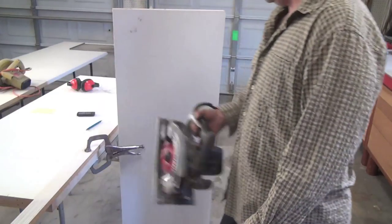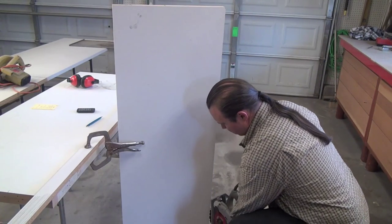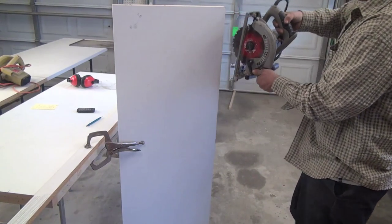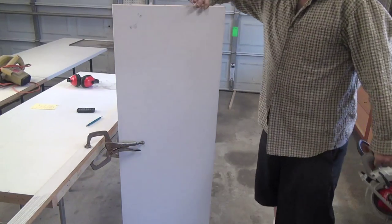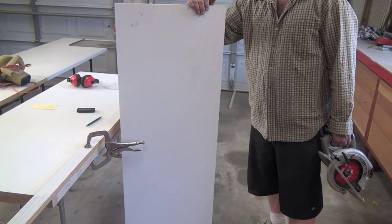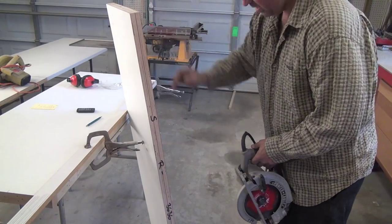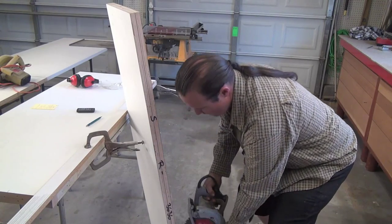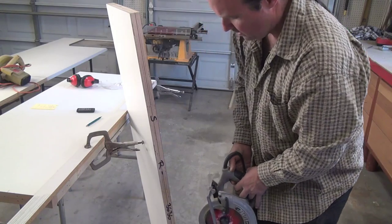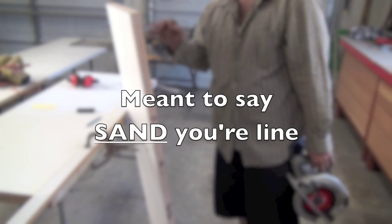Often, you can use that same technique if you're cutting along a wall — you start down low and slowly cut, working your way up going backwards. If you have an inch-and-a-half wall or leg that you're scribing, you can go backwards on each side. You'd only be going in about an inch on each side, making a V shape. Then take your sander, cut your line, get really close to the line, and you're good to go.